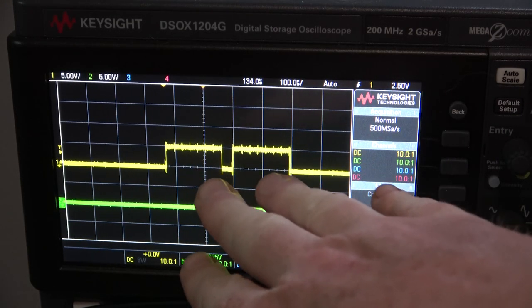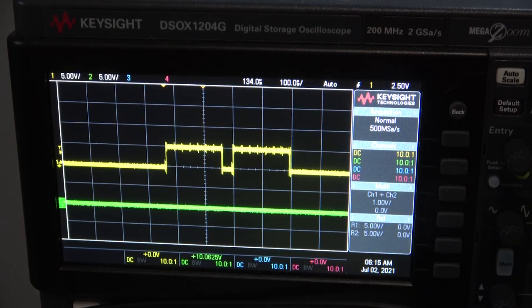Right, so here's Contra trying to read both controllers. As you can see, it's outputting the same data twice, basically. But who cares? Because the Nintendo, and I guess that would happen either way, just depends on which register the Nintendo is reading the return bits out of. Well, actually, they're in the same register. They're just different bits in a byte. But it shouldn't affect us. And now it works. So, yeah, I was just overthinking it.